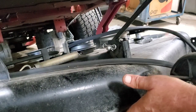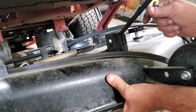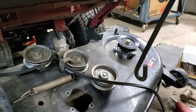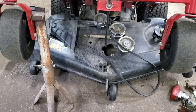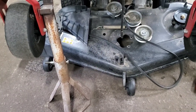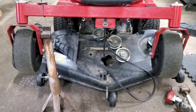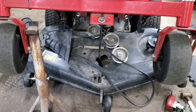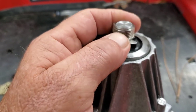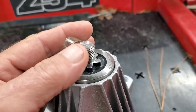You can see the belt is around this thing. On these decks, a lot of times there's just a little clip — lift up on it, push it out of the way, and let the deck drop down. You can get right to it — all the room in the world. Be sure you've got a jack stand under this equipment when you've got it up like this. I really don't want to see anybody get injured. One more little thing: don't forget to take the little thread protector rubber thing off the new spindle, or you'll never get your blade on there. Take that off before you put the spindle on.